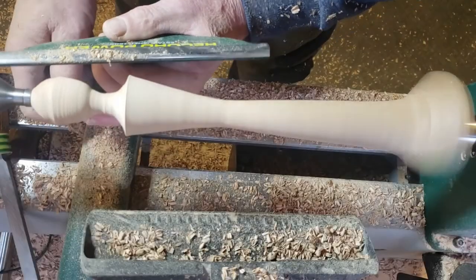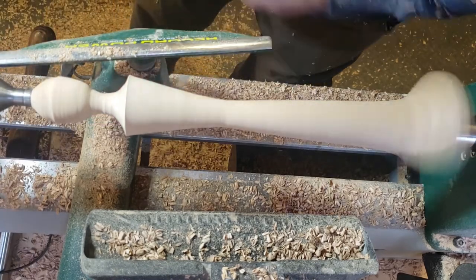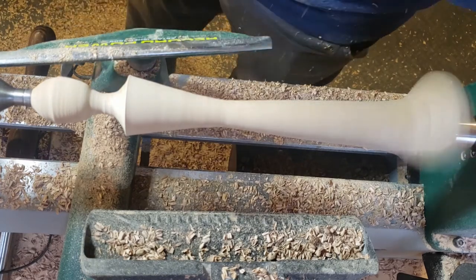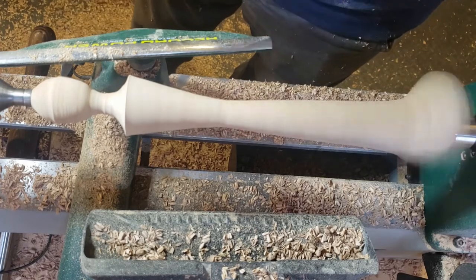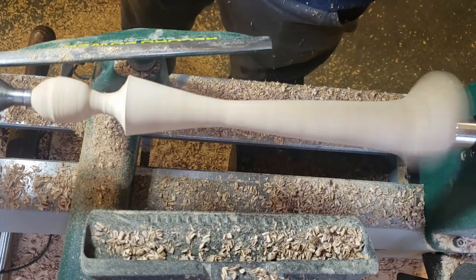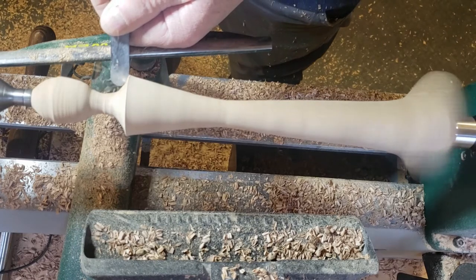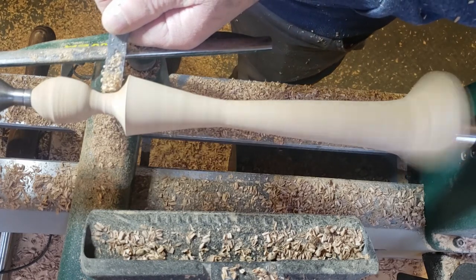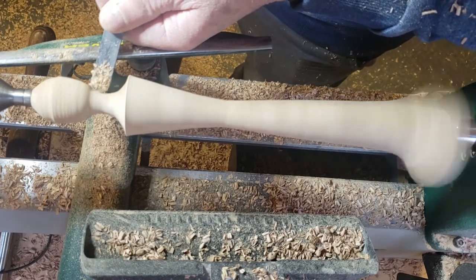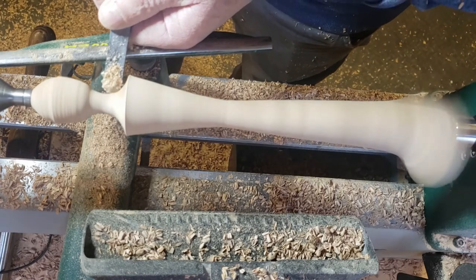So what I'm going to do now with the neck, rather than do it with the gouge, I normally just use the rounded chisel, and when you're scraping, always have your wrist sitting high and your tool pointing down, because if that was low and you're in the gutter, she would catch. So just keep your wrist high and this pointing down, and you just need a small piece of it. Very little. Just nice and easy, not too harsh on it.